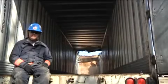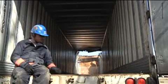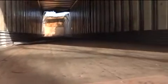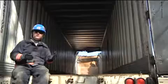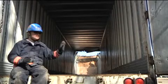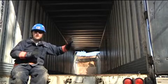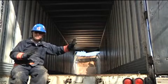We're sitting here in the back of the van trailer with the doors open to talk about some construction features. The floor is always going to be the strongest part because that's where we're putting all of our weight. The side walls and the roof are very thin — they're designed just to protect the load from the elements, nothing more. Any time the load is racked in an accident, it'll easily lean in and bow out the wall, and a lot of times it'll even puncture through and make the trailer completely weak.